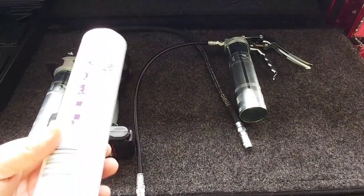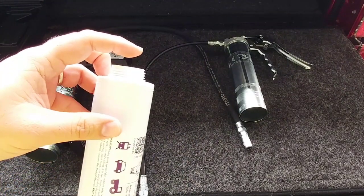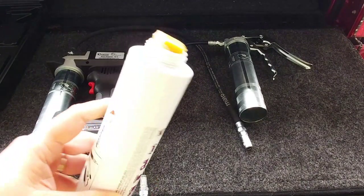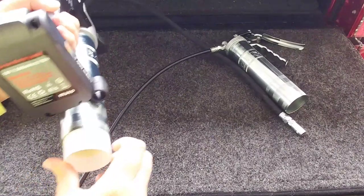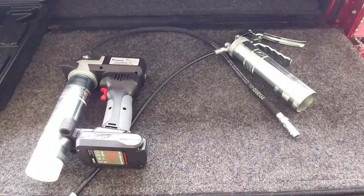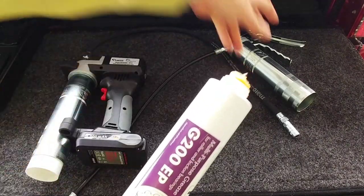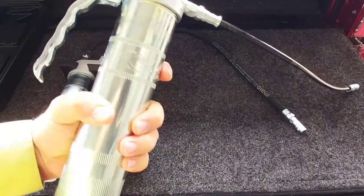The best practice to keep in mind is that when you insert the actual grease tube into the bottom of your grease gun, you need to push a little bit out just so it bulges out on top of the little rim. So you're going to press from the bottom up a little bit until you see a little bit of grease appear. You can see where it's now sticking out of the top — on the 18-volt model you'll simply slide the grease tube in, screw it in place, and you're ready to go. For the trigger pull, take the cap off the top, press the bottom so a little bit of grease comes out of the top, and then screw it into place as well.